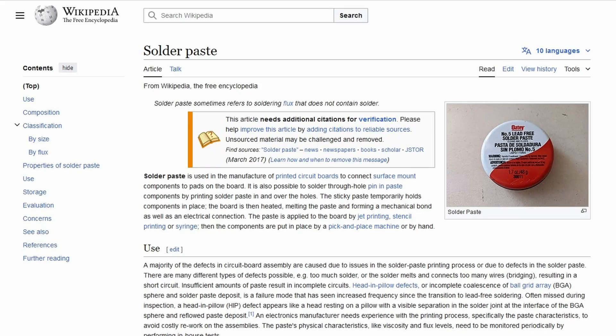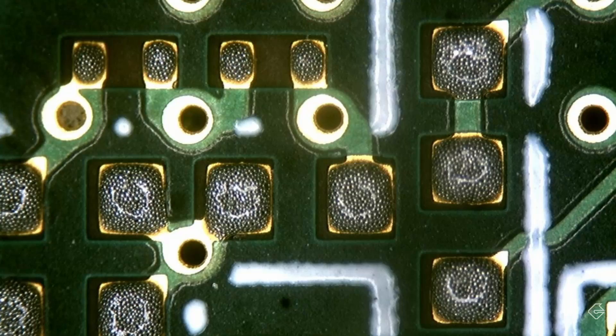For example, there are these things called hot air reflow stations or hot air ovens, which basically work on the principle of increasing the air temperature hot enough so that solder melts. But my problem with these two things is that both of them require the stuff called solder paste — basically a sticky material that you pre-apply to the pads and then you put your surface mount devices on top of those pads and the solder paste holds them in place.